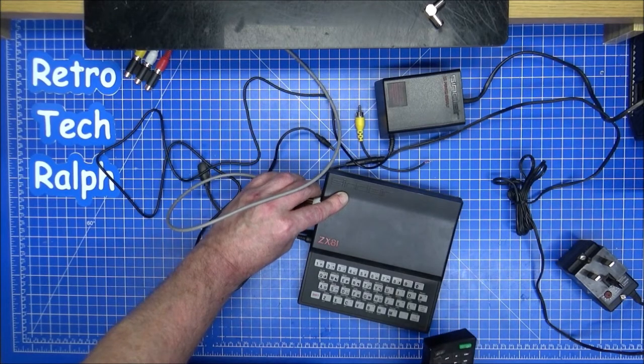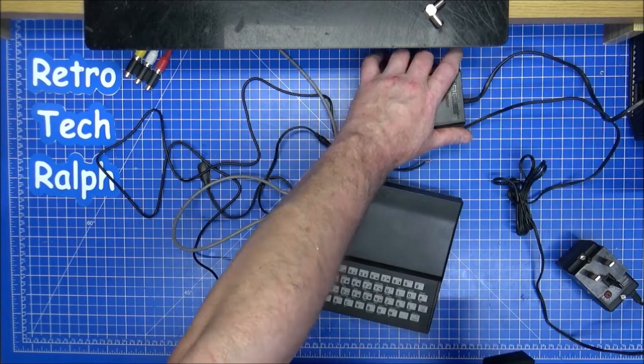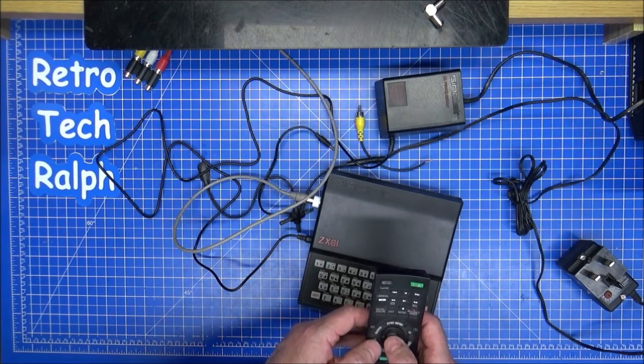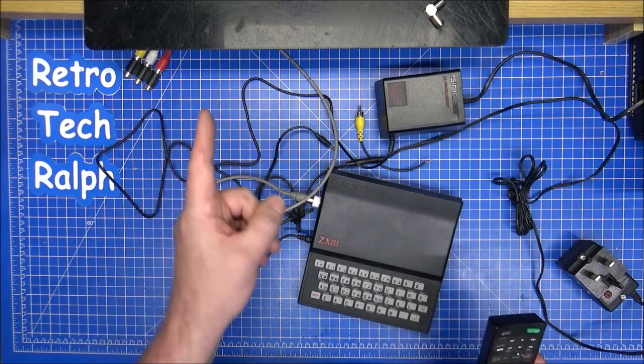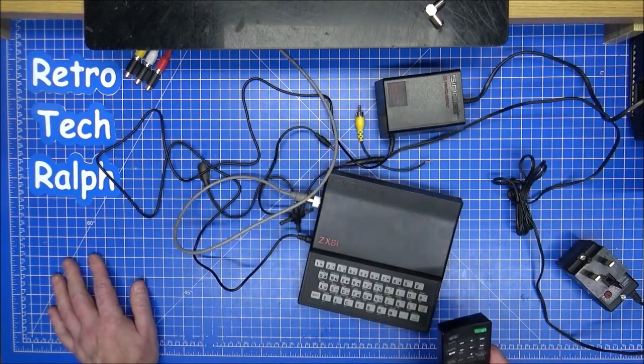We definitely have a fault with this. To run the power supply through, it definitely ghosts on something on 36. Let's try for 35 again. It's getting a full signal, so the TV is showing there's a full signal. It's got some sort of quality signal coming through. Problem is, is it this? It's got to be this. Can't be anything else in here. I can't fine-tune this like an old television.